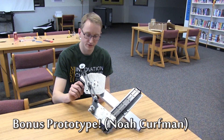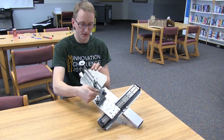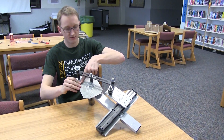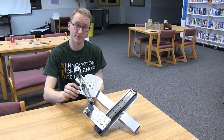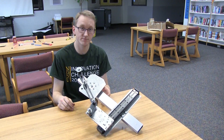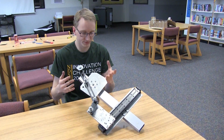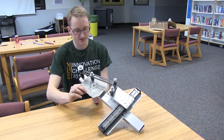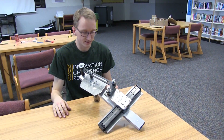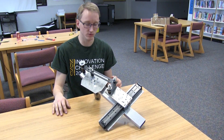This is one of our designs for a shooter that we ended up not going with. It's a quick return linkage system: a motor connects to this plate here that rotates, and as it rotates it pulls this linear rail back, and then when it gets to the bottom of its travel at this rotational joint here, it slams it forward, and that slamming forward motion would throw the ball forward ideally. An advantage is that you'd have a perfectly consistent hit on the ball almost every time, where with a rotary motion it might not be quite as consistent. The biggest downside is the complexity — two linkages and four joints all have to work together — and it's pretty high maintenance and tends to break down a lot. We didn't have time in three days to make this work properly.